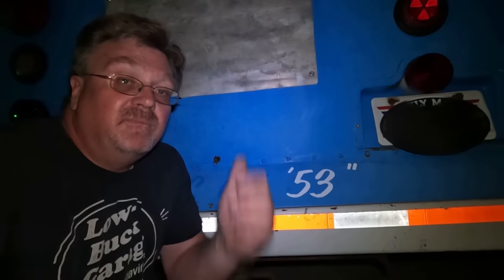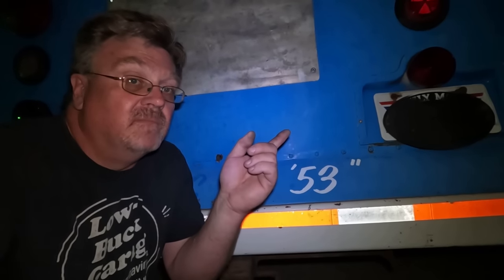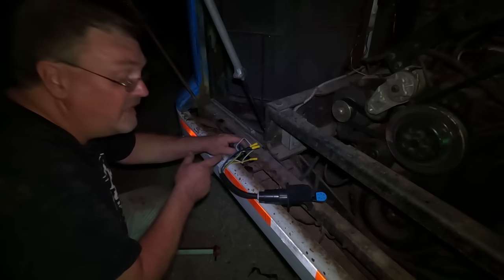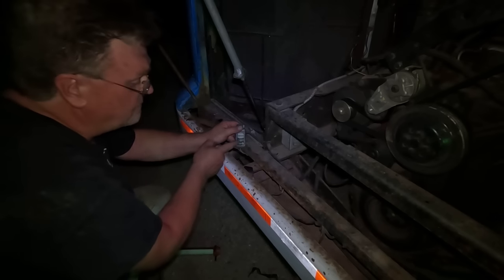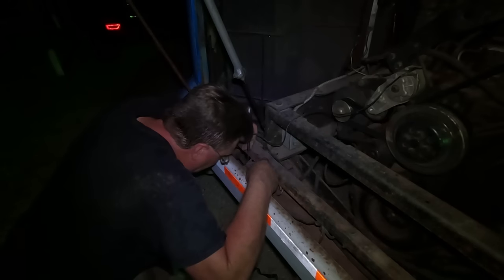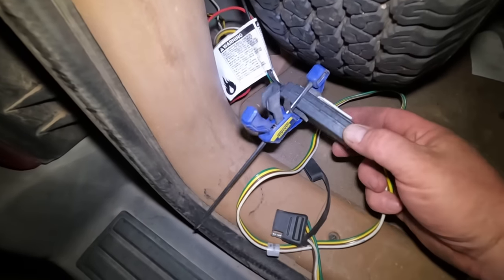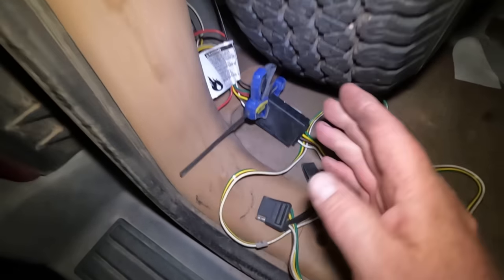This bus had been sitting for almost 20 years before I drove it back from Connecticut. Even though it has a trailer plug, I don't know if it actually works — I probably should find that out. I also got a 7-way round plug and tester from Nylite. With a complete disregard to the unboxing video I was expected to do, I started using them. I checked the connector and we've got nothing on the bus, so that means we have a problem. It's one of those electronic converter boxes that almost always goes bad immediately. We've got power going in — yep, it's just the converter box. The tricky part is the signal and brake light, because this bus uses two separate lights and we've got to make them work on one. This is my most recent and best signal converter box, but that clamp has to stay right there for it to work, otherwise it loses one of the signal lights. I don't think it's worth stealing this one.